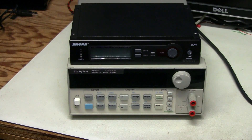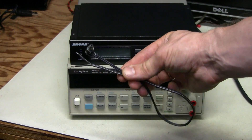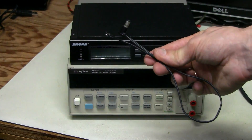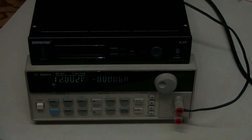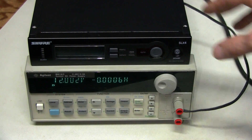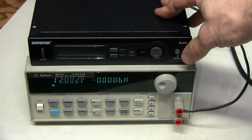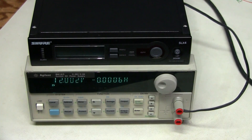I keep a collection of all sorts of wires and connectors for such purposes, and I found this little piece of wire with a connector which fits this receiver. I suggest to double check the polarity — in our case the center pin must be positive. I set a 200mA limit. Let's try powering this up. I believe this is a soft button, and absolutely nothing is happening — no current draw at all.